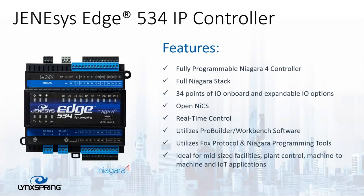Now let's talk about the Genesis Edge 534. It contains 34 points of IO on board and has the ability for expandable IO options. We're going to be using the XM34 IO to connect to this to make a very large controller. It also contains the full Niagara stack and an open NIC, which means that you can use any flavor of Workbench as long as the Edge files match that specific version. Currently we have 4.9U1, 4.10U4, and 4.11U2. If you use anything like 4.12, that's not really compatible. Please make sure that you have the correct workbench installed — you can find all that information at resources.linkspring.com.